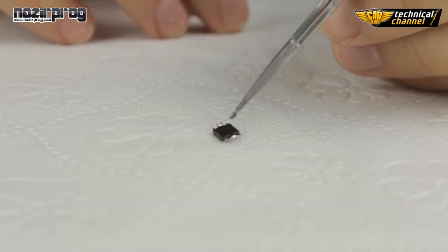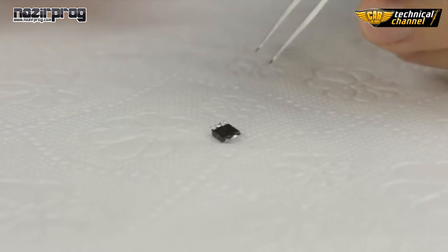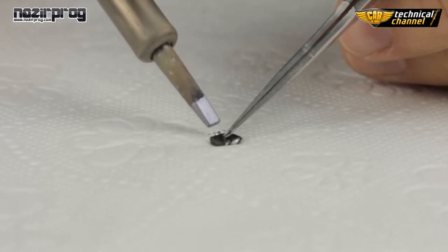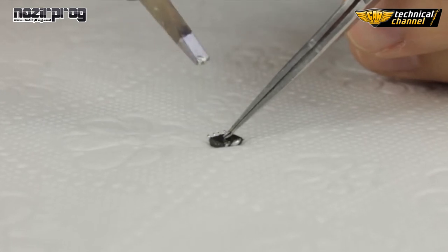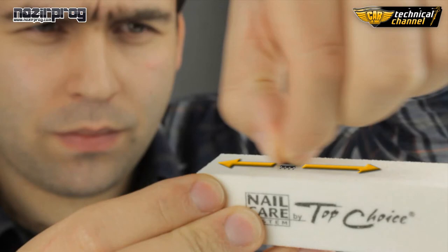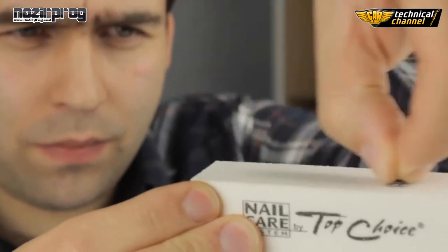If the memory legs are soldered together, you have to hold the plate with pliers and use the iron gun to remove the excess of tin. Now, using a polishing block, clean the base of the legs. To not bend or damage the legs, do it very gently without force. The memory moves along one axis. Memory cleaned like that is ready for programming.